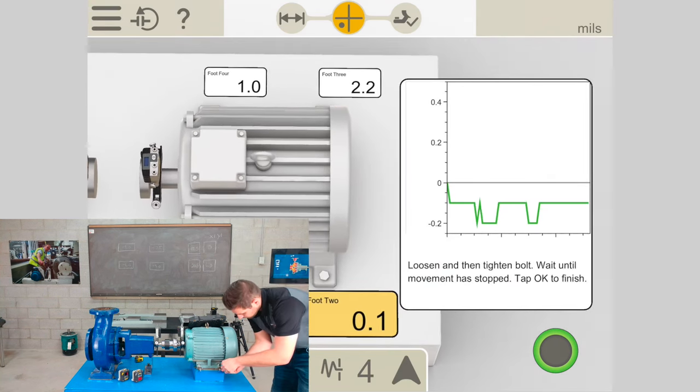At the bottom of the screen I have a filter option — if there's a lot of vibration nearby causing the beam to fluctuate, I can increase the filter up to 10 seconds. In this environment I'll keep it at 2. I have two measurement methods available: Easy Turn and 9-12-3. The 9-12-3 is the clock method — I go to the 9, 12, and 3 o'clock positions and take measurements. I'll keep it at Easy Turn and take some measurements.